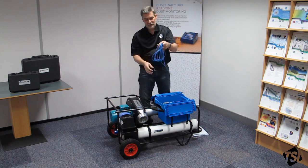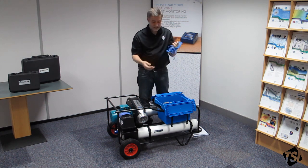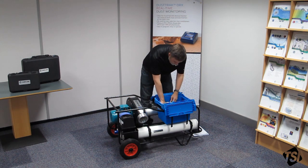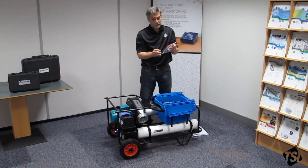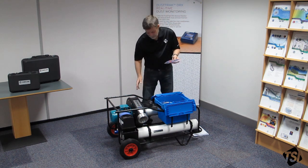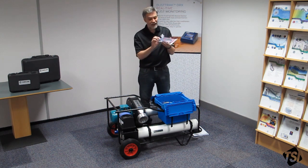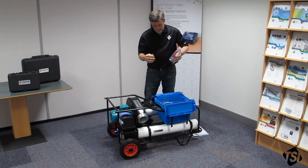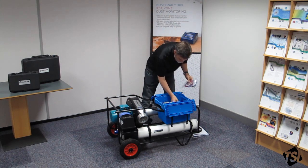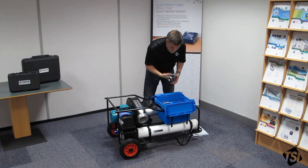You are provided with 5 metres of flexible tubing so you can measure the static pressure from your duct under test and connect it back to the instruments. There's another pack with some red and blue tubing; this is so you can connect your TA465P to the flow grid to measure the flow or the leakage rate. There are also some adapters in here which allow you to connect this tubing nicely onto the instruments. Two clamps are included to clamp your flexible duct to the duct adapters.